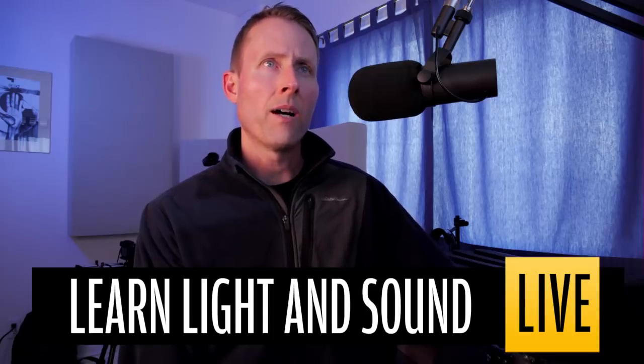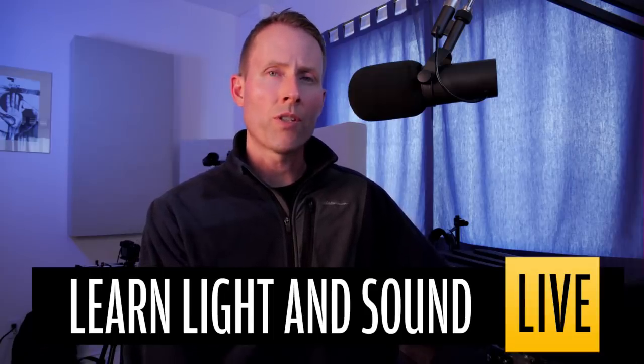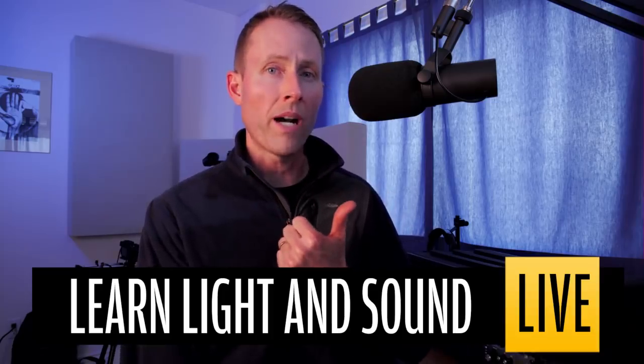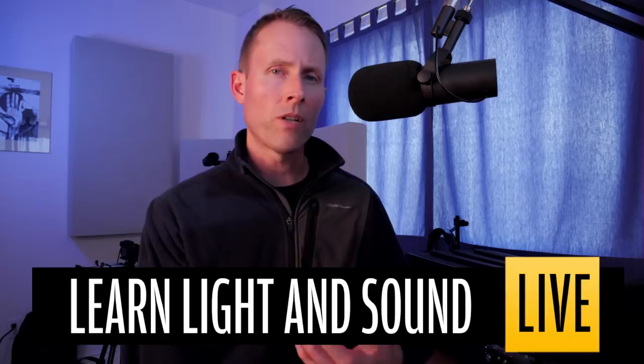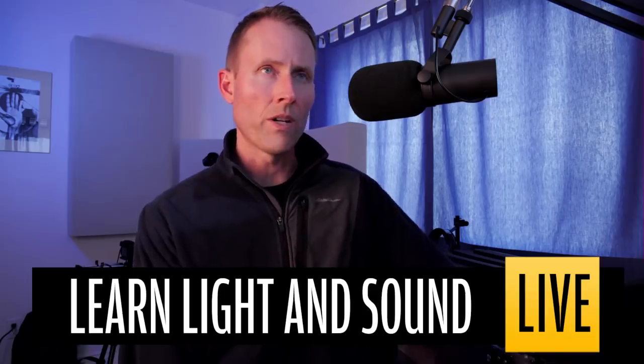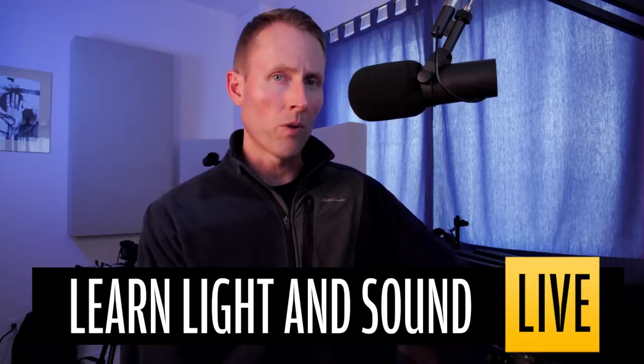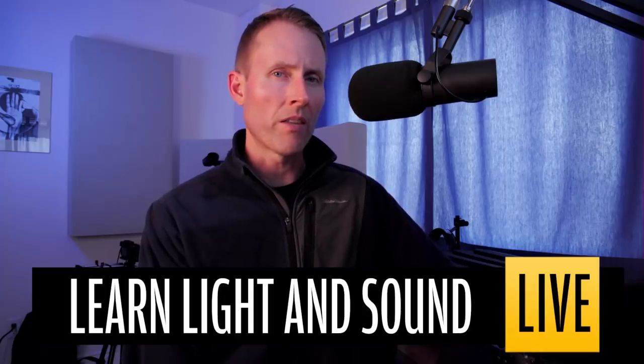I would say. But the other thing that the Sennheiser MKH-416 gets you is, I think, two things. Number one, it's an RF bias design, so it's going to hold up a lot better in high humidity situations. That's one thing. Number two, it has a more directional polar pattern, so it's a little bit better at rejecting things off to the sides and to the rear.